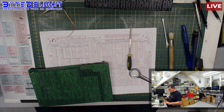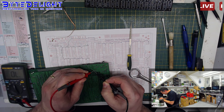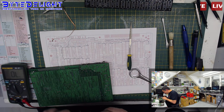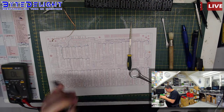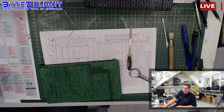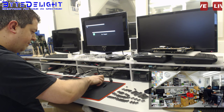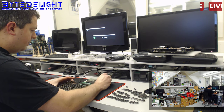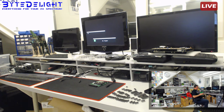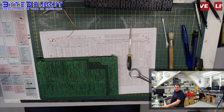It's not doing anything. It just gets 9 volts in, but there's nothing coming out. Okay, there's no short anymore there. That's because of your top connection. So we're going to do another test, at the other side, of course. Let's see. Do we have 5 volts now? Nope, still no 5 volts. Oh man, that's a pity. Okay, so that most probably wasn't it. I really wish it would have been. So we have to continue debugging.